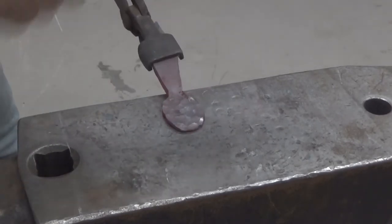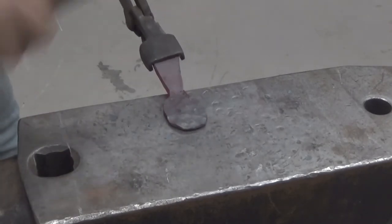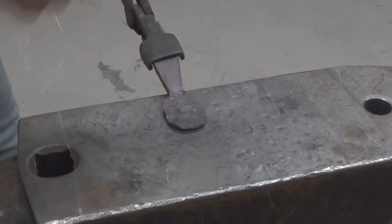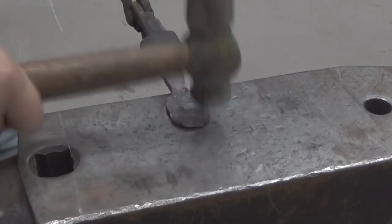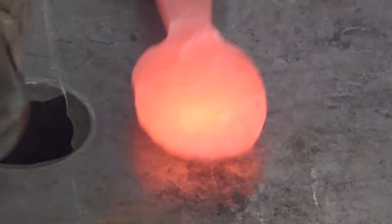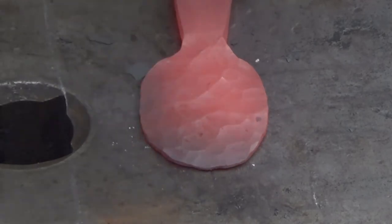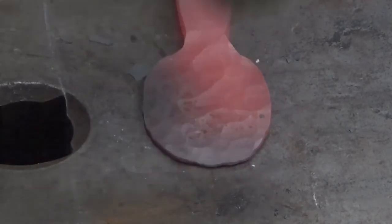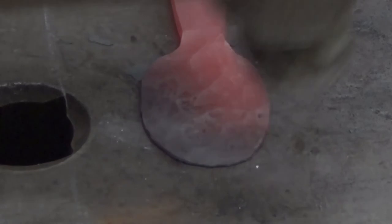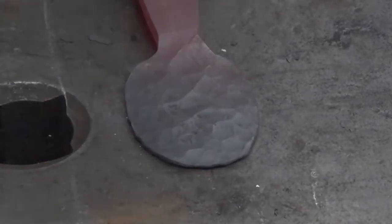You can see how effective it is at moving material here. Once you have it nice and thin, you're going to go around and tidy up the corner — the way you do that is you just go around very meticulously and carefully, and anywhere where it doesn't look like it's sticking out quite enough, you'll hammer that down and it should push it out so that you get a nice clean looking perimeter.